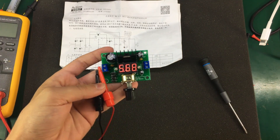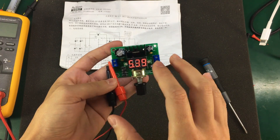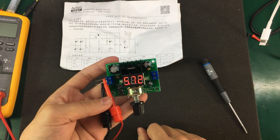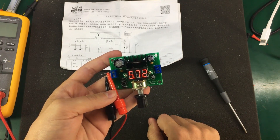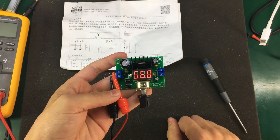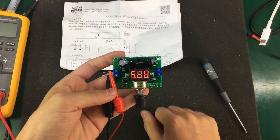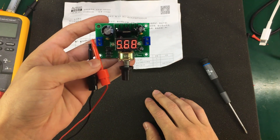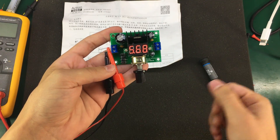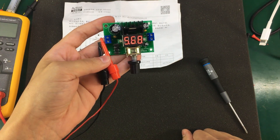I'm glad I managed to fix it. I'm going to upload this anyway even though it was a bit of a failure on my side — I didn't notice the resistor supplied in the kit was the wrong value. So make sure that if you get one of these, always check the values of the components before assembling. If you notice anything strange, correlate those with the datasheet of the device or the supplied schematic. As always, thank you for watching. There will be links in the description for this kit and the tools I used. Give me a thumbs up and I'll see you next time.